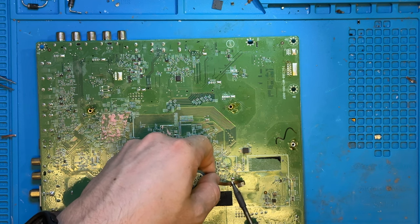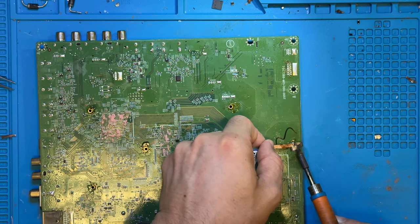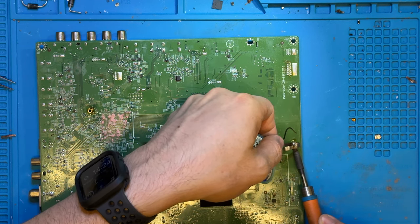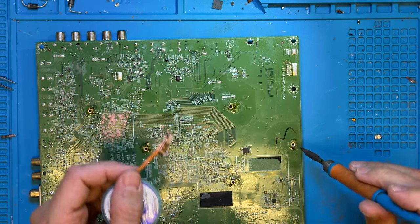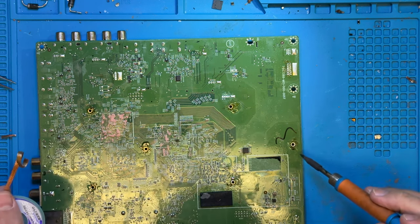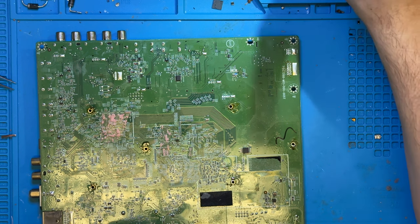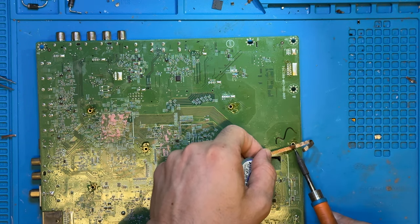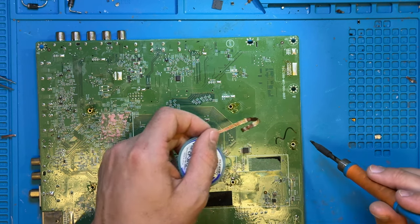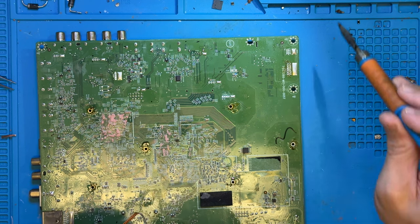We're on our last two holes for cleaning. If you're not getting good heat transfer, definitely look at your soldering tip — it's probably dull and not conducive to heat transfer. Always make sure you're tinning your tip regularly. That's a huge one for people just starting out.